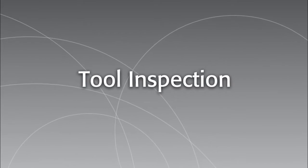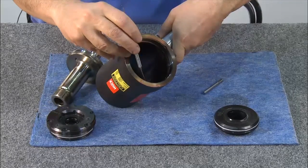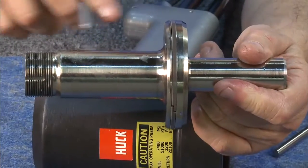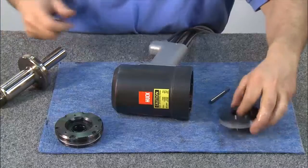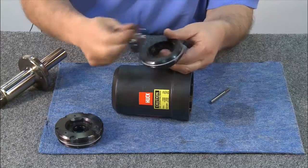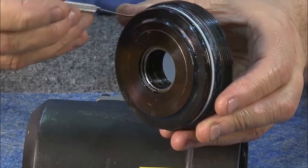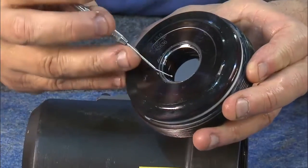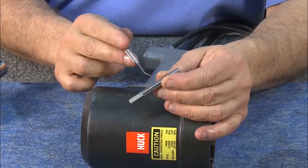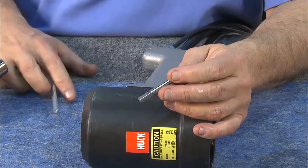To inspect the disassembled 3585 PT, first check the interior for scratches and score marks. Inspect the front and rear sections of the cylinder for scratches. Inspect the piston, looking for score marks on the front or back. Inspect the front gland — take it apart and add new seals to the inner and outer sections. Replace the seals on the back cap, both the inner ring and outer ring. The inner seal is held in place by a small lock ring, which is removed prior to replacing the seals. Be sure to inspect the dump valve, making sure there are no heavy scores or nicks, or any scratches on the edges of the flats.